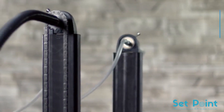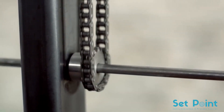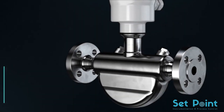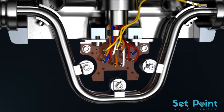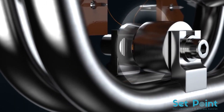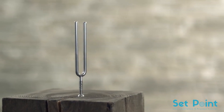The effect also appears with an oscillating movement — the twisting is stronger or weaker depending on the amount of water flowing through the hose. This effect allows the mass of liquids or gases to be determined. The Siemens Sitrans FC 430 flow meter functions according to the same principle: two symmetric metal tubes are set vibrating by a driver coil in the central section. The tubes oscillate at a resonance frequency, similarly to a tuning fork.